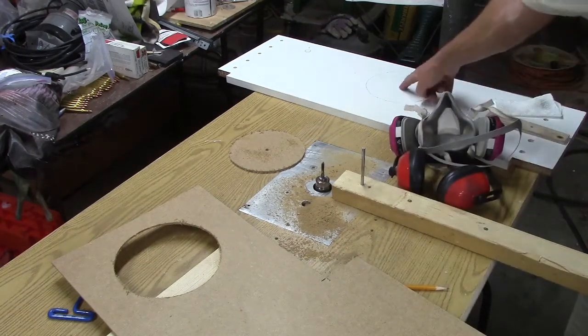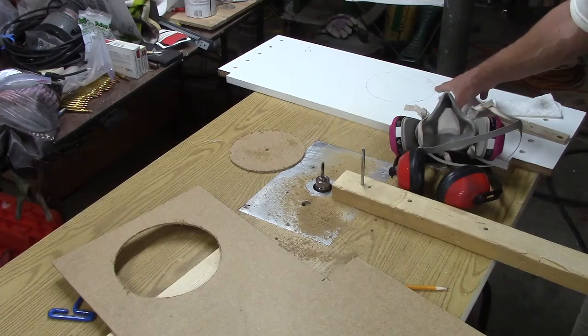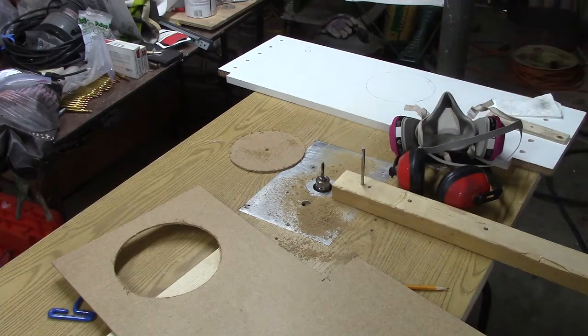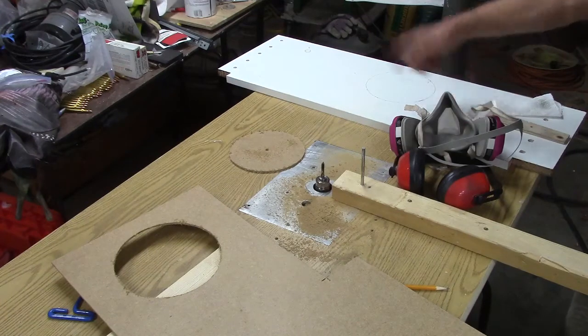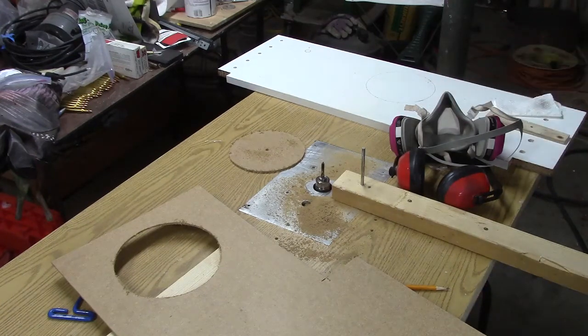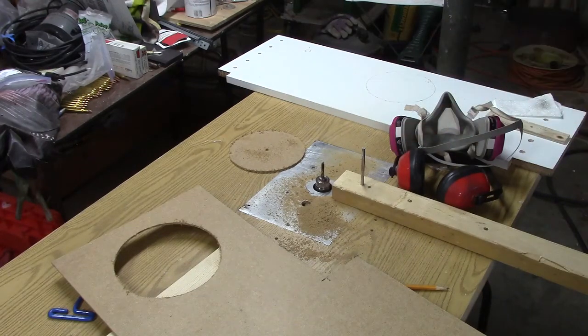And I'm going to poke a hole here in the middle of this piece of melamine board, which is the first piece that has to be penetrated. I screwed this up into place and put the vent fan into place and traced the inside of the hole, and then took this back down again. I'll use the router compass to cut that one, and then all the rest of them I'll use the router template. Okay, see you soon.